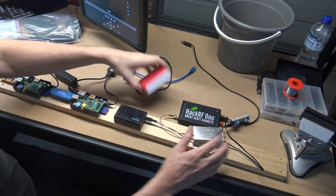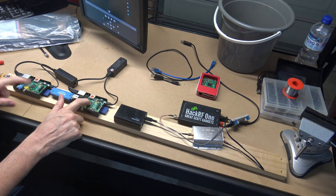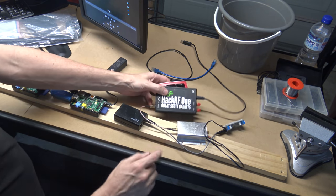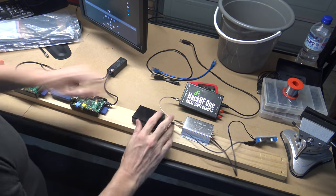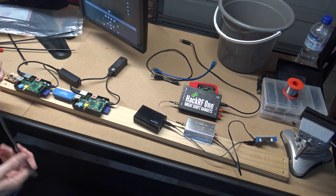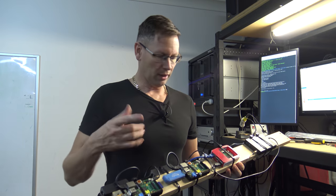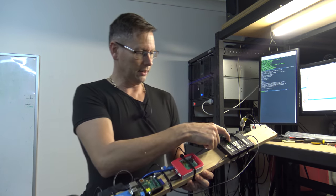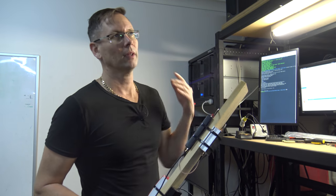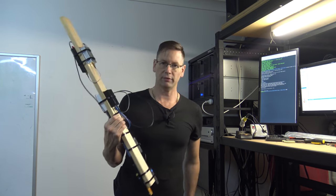While it's raining I thought I'd take all the stuff down and redo it. I'd like more modern Raspberry Pis but for now I've got two Raspberry Pi 1s with RTL-SDR dongles and the Raspberry Pi 3 that will go to the HackRF for transmit — that's why it's got the power amp on it. I'm going to zip-tie them to a block of wood. A bit rough and ready, but it'll do. So I've got three SDRs: the two receivers on the Pi 1s and the HackRF on the Pi 3, whose RF output goes to the RF amp and will connect to the new antenna when the rain stops. I'll put this in the roof now and play with receive only until I can transmit.